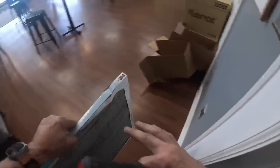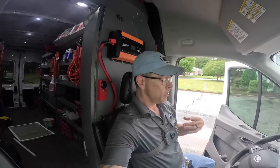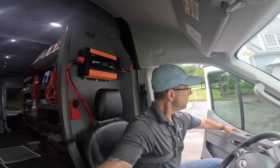All right, everything I gotta do is outside — you can go ahead and lock up and do what you gotta do. When I was brushing off the filter grill, that dust — some of it got on my lips and I could taste sugar. So it's sugary flour, I'm sure. Pressures didn't look any better when I changed the filter, but the sight glass is full so I'm just gonna leave it alone. That one was basically just a clogged drain.